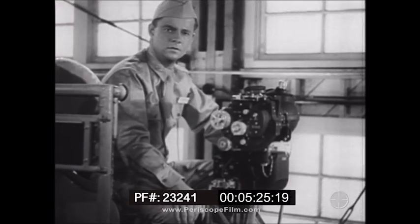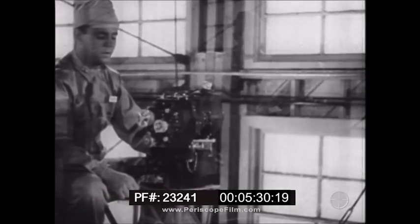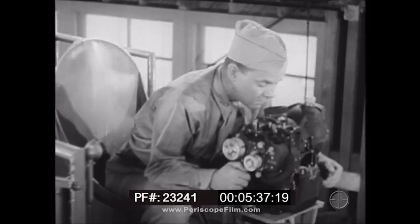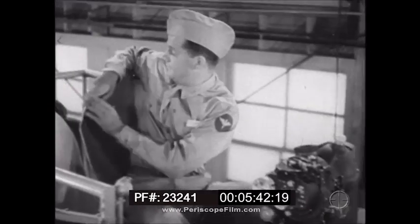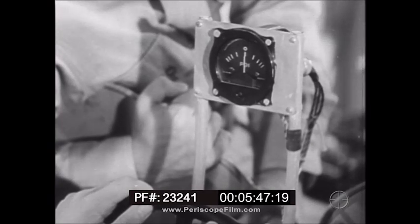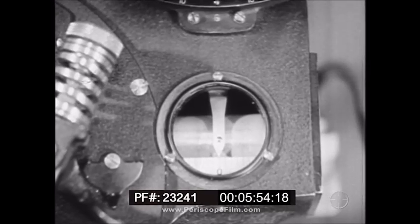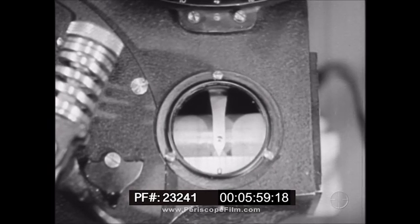Let's take a crack at course now. Let's go. Before you get on those course knobs, lean back and take a look at the PDI in front of the pilot. Whenever that gets off center, the pilot is going to change course until it's back on zero. Here's what makes the PDI move — the brush on the stabilizer. Center it and the PDI is centered; move it, and the PDI moves in the opposite direction.